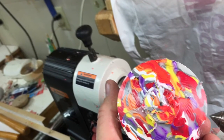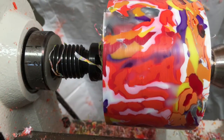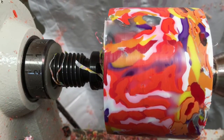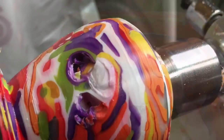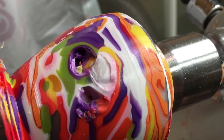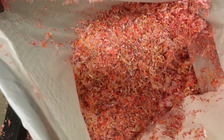I chucked it up and started to do some turning, and I was loving the way it looked. Great texture throughout, really cool coloring. But as you can see, I started to find some voids. These places were either air pockets when I was clamping, or more likely it shrunk. I turned it down to just shreds and decided, what the heck, I'll melt that down and see what happens.